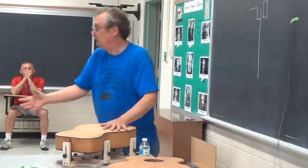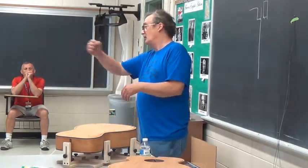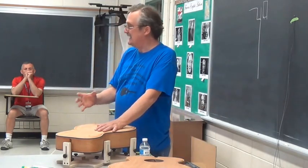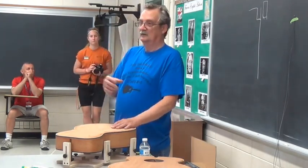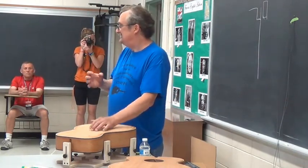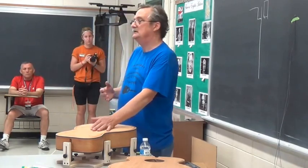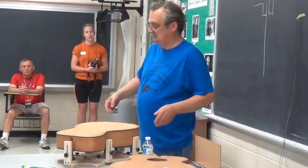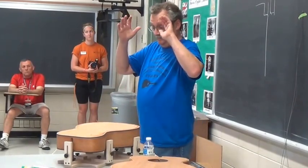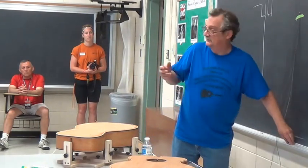So when you're routing, whether you're using a tower jig, I love the arm jig, because that gives me that third variable in my hand. I can feel what's going on. We've all routed wood where you're getting somewhere, and I call it the flap. You can hear the sound getting a little slappy. You can take off of there and back feed, because nothing's more frustrating than blowing out a big chip out. So in order to route, I will do a series of climb cuts and route cuts.